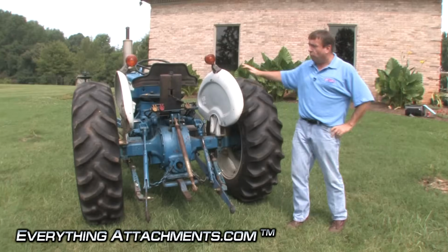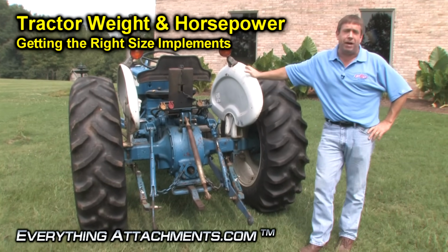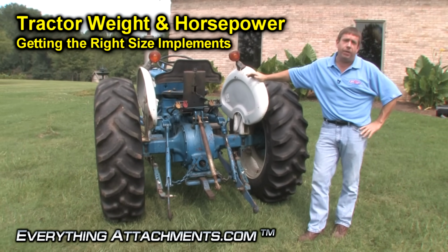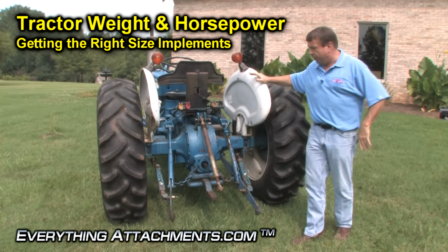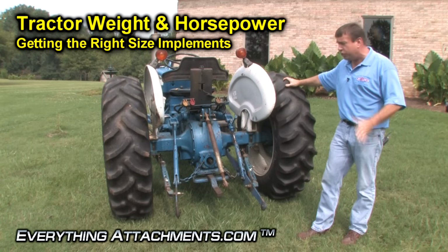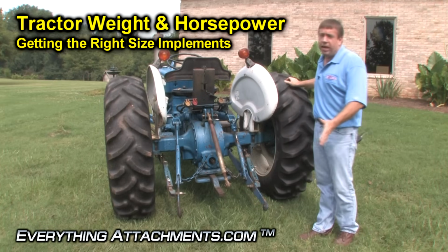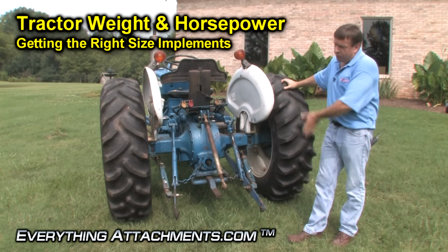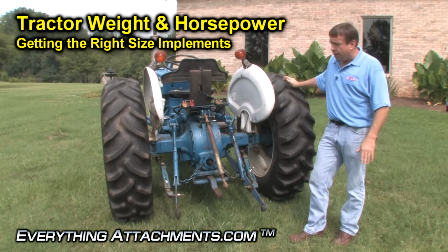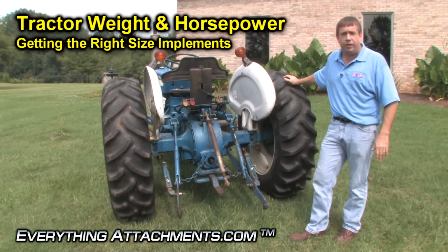Okay, so on a Ford 3600, this tractor without a loader or anything special is in about the 5,000 pound range, which would be really heavy for a compact tractor nowadays. So these two-wheel drive tractors in the 5,000 pound range did really good just simply because of their weight. This tractor would handle mostly 6 and 7 foot equipment. Any type of dirt working equipment, I probably would use 7 foot stuff on it. Rotary cutters, things like that are heavy and long back behind the tractor, probably 6 foot.